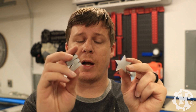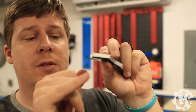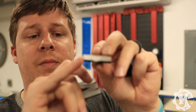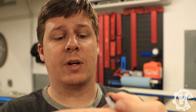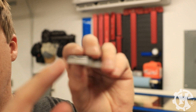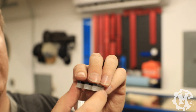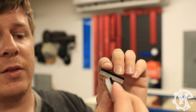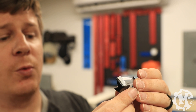I have both sets here. This first set was with the translucent on top and the black on bottom. They honestly look about the same. The only difference you may see is the taper — there is a slight taper when you're cutting with the laser, especially when you're cutting thicker stuff. So you may see a little bit of an angle on some of the pieces, but they're still fused together perfectly and they're not going anywhere. With the black ones, there's more time for it to run across the black piece and it does melt pretty well onto the clear. But again, there's not a noticeable difference between the two — you probably couldn't tell which material I had on top just because of how well they bonded together.